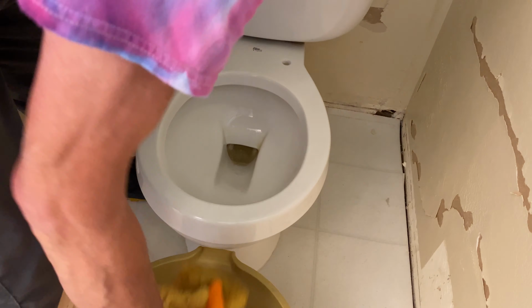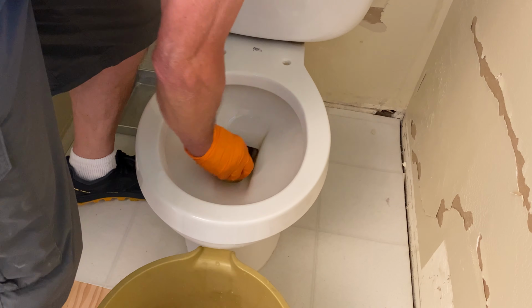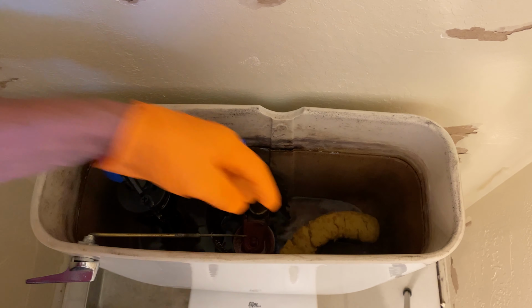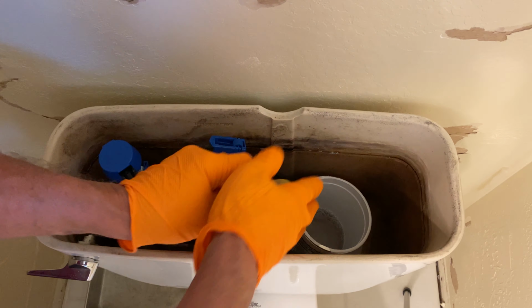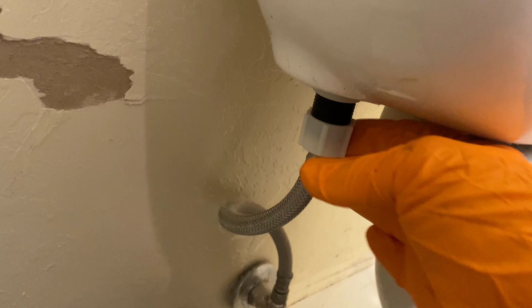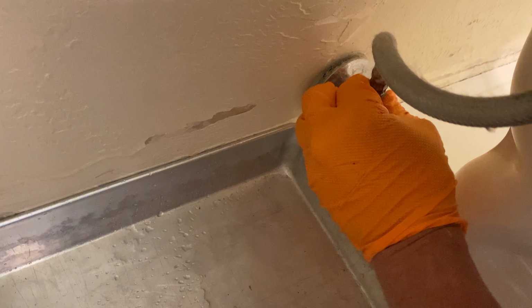I'm not keeping this toilet. It's really not a very good one. It's an Eljer 1.6 gallon. It never really did a very good job. Get the remaining water out of the tank. Probably should remove the flusher here. The drier the better. Now it's safe to unhook the water supply valve because there's no water in the tank. Very little. Water supply hose, that is. Hand tighten usually.